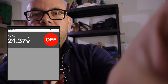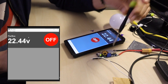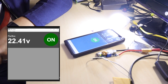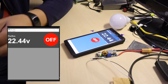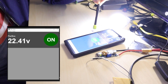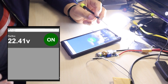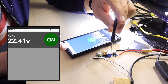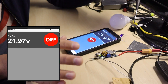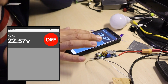So right now I have a fake battery right here. Let me just take the voltage up — you can see here it's 22, and also on the computer it's 22, so the voltage is just about the same. Now, if I want to turn off the battery I can do that, and also if I want to turn it on from my house I could do that. But if I went out and I see that my battery is going to be under voltage, I could just turn it off. But let's say you forgot to turn off the battery and you already have the low voltage set to 22 — as soon as it hits 22 or under 22, it's going to be cut off. And if the person tries to turn it on, it's not going to be able to because it's under voltage.